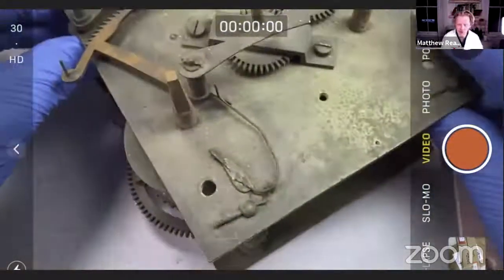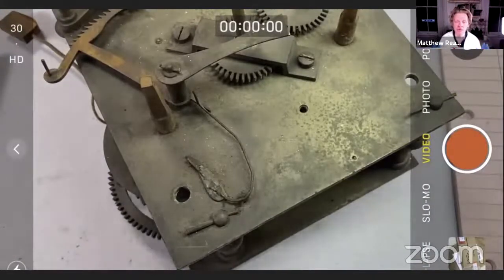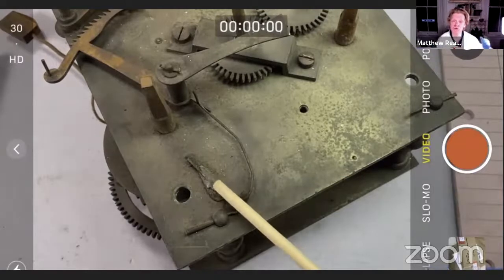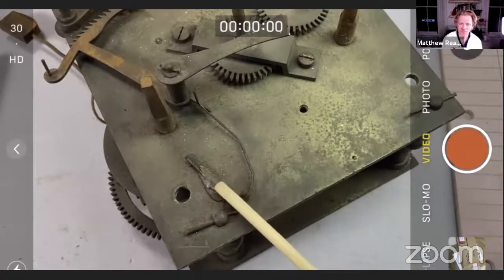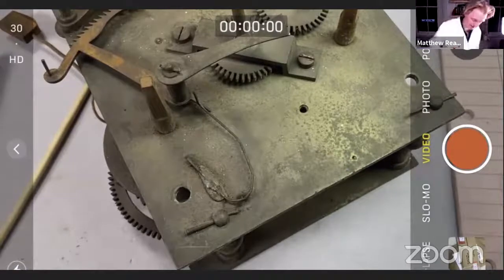Okay, so we'll have to have a closer look when we get the frame apart. It looks like it was screwed on and the screw sheared off in the hole. Somebody's over-tightened it or whatever. And then in a separate train smash, it's been soldered on. But because it's been soft soldered, thankfully not brazed, on the front plate, it's really difficult to get enough heat in there. So it looks like it's kind of floating about on the surface. But if I get a pair of tweezers,